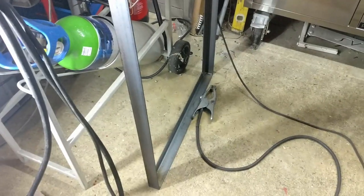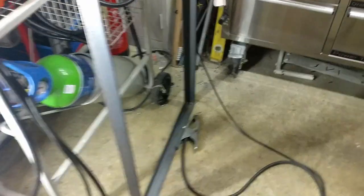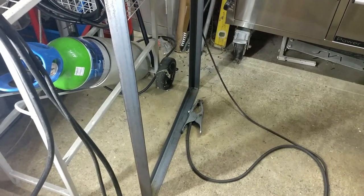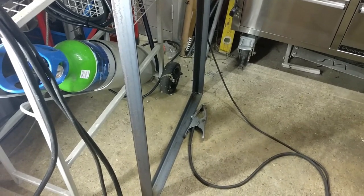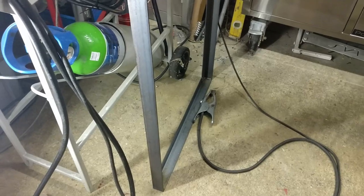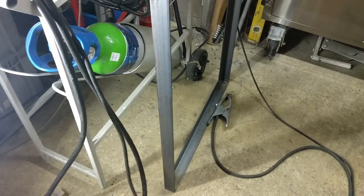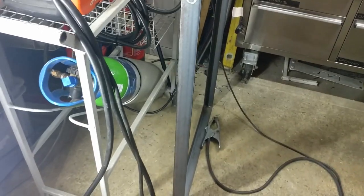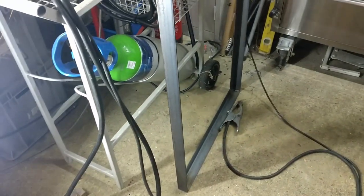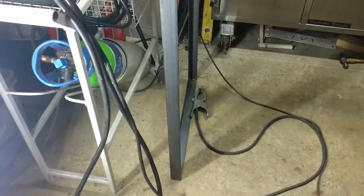I didn't necessarily have to put those stretchers across the bottom, but I don't think I'm going to be lucky enough for it to sit right where the beams are on the bottom of the shed. So I wanted to spread the weight of this shelf across there, and welding a piece of flat steel to the bottom of it would have made it not sit flush to the cupboard or the edge. And leaving just the angle, it would end up rocking and cutting through the timber. This is only like 12mm plywood, and plus I've got a lot of this angle left over — it's no big deal, probably about 20p worth of steel there.